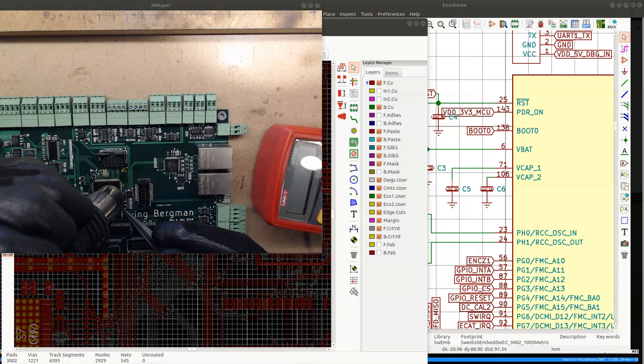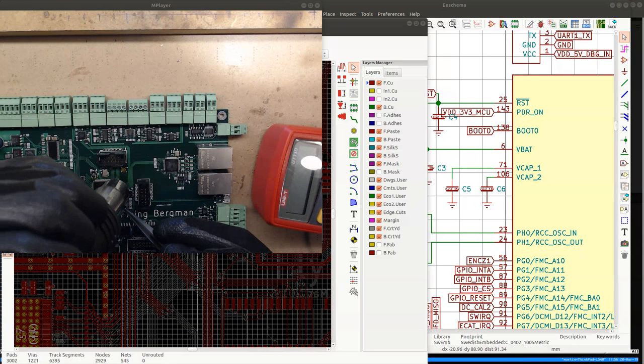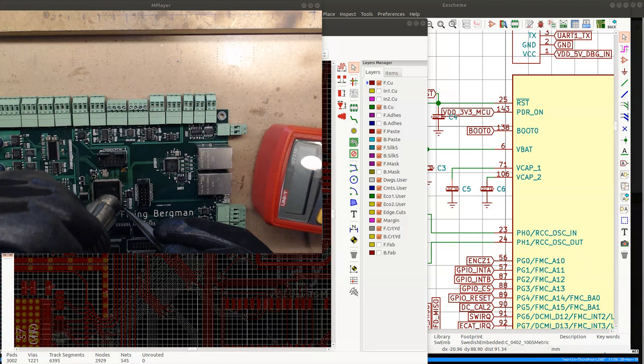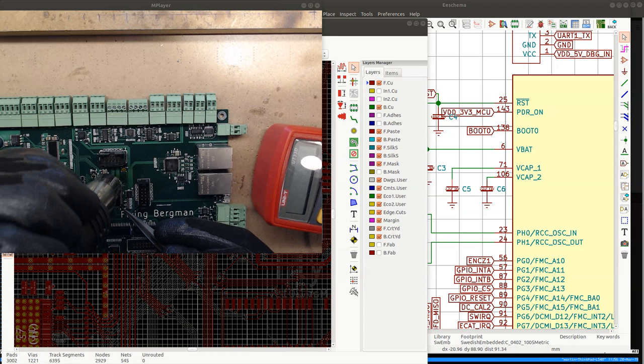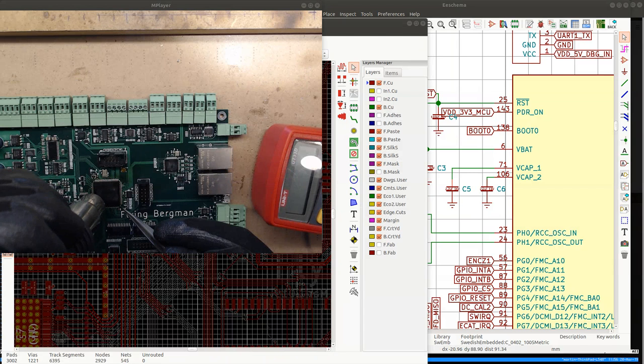And I'm gonna try placing this chip on the board that I fixed, where I had shorts even between the 5-volt and 3.3-volt rail. So there could be other things that are wrong with that board, but for now, I wanna make sure that everything is fine on the CPU side, so that it's the CPU that's broken and not something else on the board. So in either case, if I move the chips, then once this chip is soldered on the other board, if it doesn't work, then it's something wrong with the board, and I can debug the board until I get it working. So that's what I'm trying to do right now.